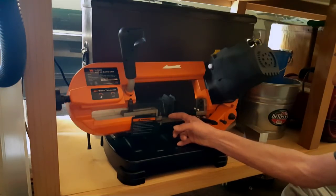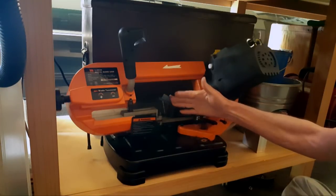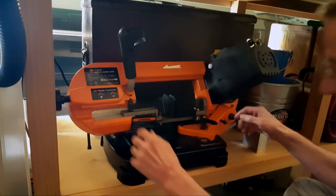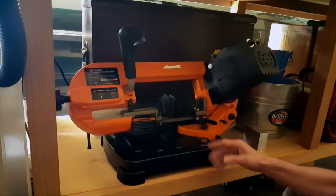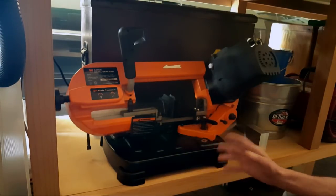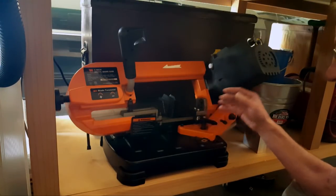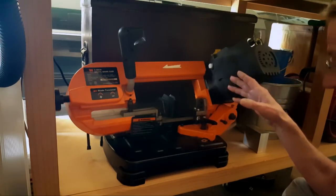First, I'm running it, and I can see the blade bobbing in and out, or not up and down, but you can see it. There's a kink in it, some long kinks. So I take the blade off, and I lay it on a flat surface, and I'm rolling it, and you can see, okay, it goes up here. So you kind of bend it a little bit, and you look at it until you get it straight, and then you roll it and you find more spots. So after a lot of fiddling around with that, I finally got the blade pretty straight.